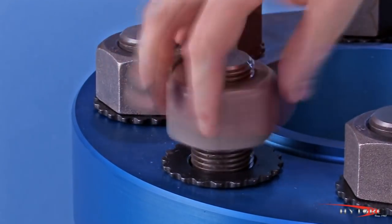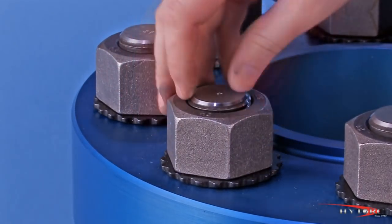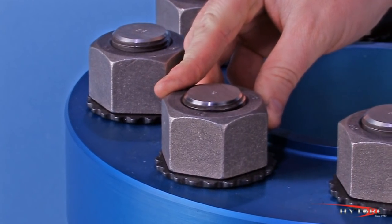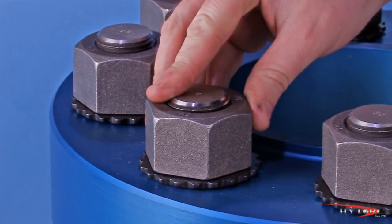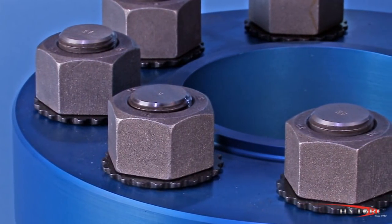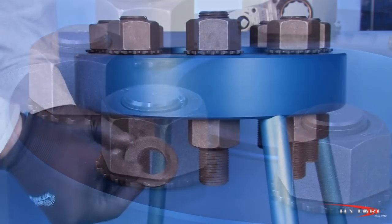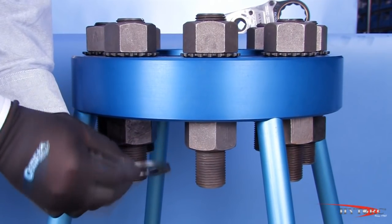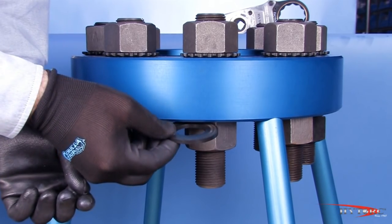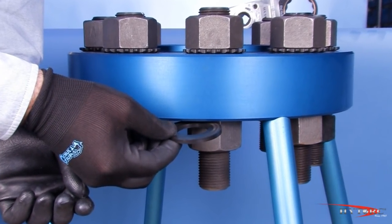It is permissible in areas of high corrosion for the stud to be flush with the nut after tightening, to lessen the risk of thread damage and so that the nut can be more easily removed. Normally, no lubricant is necessary on the backside nut. Often the back nut tends to turn during tightening, requiring the use of a clumsy and dangerous backup wrench, which creates a pinch hazard and may have to be beaten off.